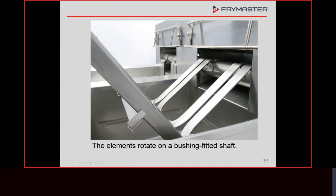The design change we made in May of 2006 was adding a cylinder with seals on both sides to reduce oil migration. Prior to this — it's hard to believe it's been 14 years — the elements were on a plate, and whenever the elements lifted up, that plate would open like a trap door. We had some issues with oil migration when people were cleaning the fryers with elements up and ladling oil down to wash the sides, and the oil would get in the back.